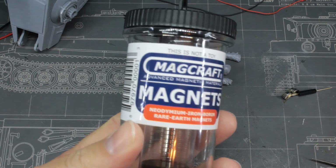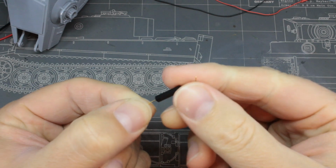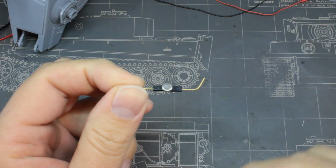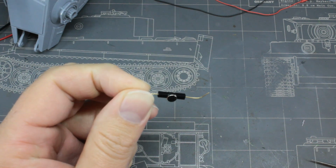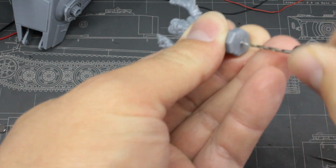So I ended up using a magnetic switch that will be mounted inside the commander's hatch of the AT-ST, and a 1/4-inch magnet that will be mounted in the base of both Chewbacca and the Imperial officer. So when they go into the commander's hatch, the circuit will close and the blasters will come on.